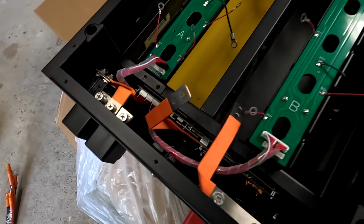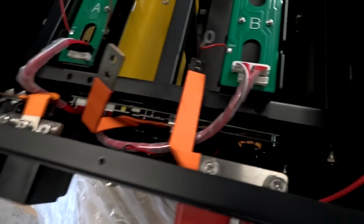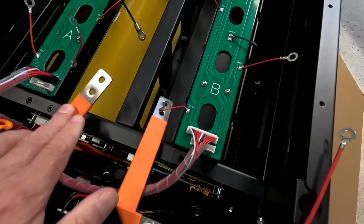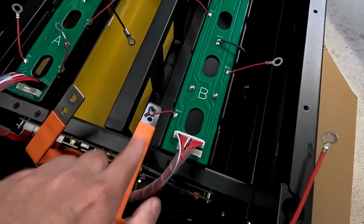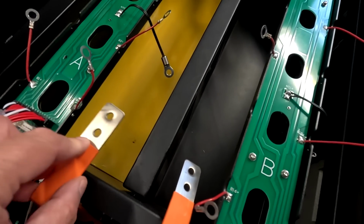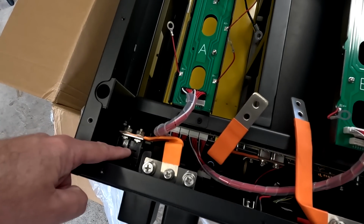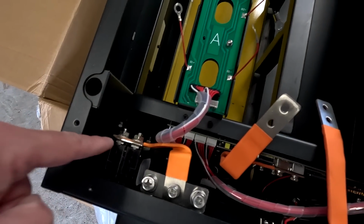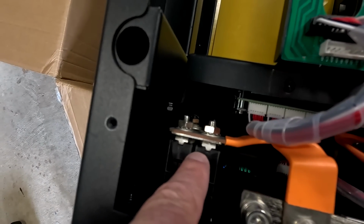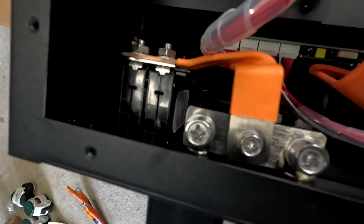We just want to have a quick look at the JK BMS here at the front. So, interestingly, this design has the JK BMS screwed against the compression plate. And as we can see, they have used flexible bus bars to connect to the main positive and negative of the battery. And this one is obviously designed for double pole terminals of your batteries. And another thing I noticed is the circuit breaker is actually in the negative path of your battery, not in the positive. And this is also a double pole circuit breaker, but they have just bridged these 2 contacts. Interesting design.